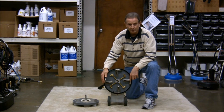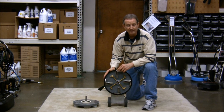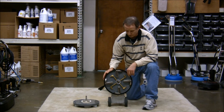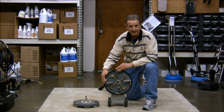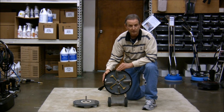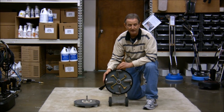Now, with four vacuum shoes and four spray jets, you're going to get about 25% faster cleaning through the job. Because of that increase in vacuum area, you're going to want to use this with either a truck mount or a dual three-stage vacuum portable.